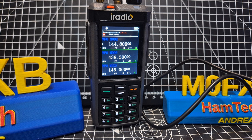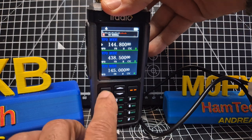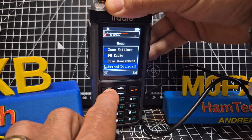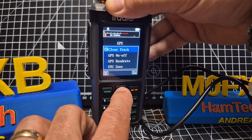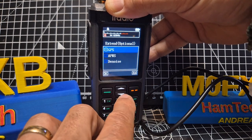There has been new firmware version 1.05 which has added GPS APRS, but if you haven't got the GPS module inside, I feel that even APRS on a fixed location — a location that you enter manually — is still not going to work. If you go to Menu, Basic Settings, scroll down to Extended Menu, Extended Functionality, and enter, you can go into GPS and turn it on. Let's go back, but we're using fixed, so let's just go in there — on/off — and go back.